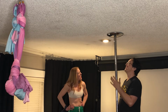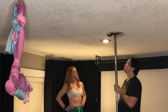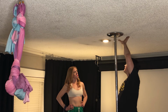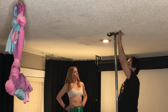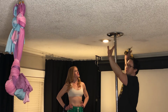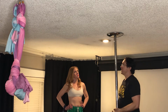We'll link it below. So this isn't holding up anything, isn't really part of the structure, but because we have it here and people are swinging on it and we want to make sure that it is as safe as possible, we're going to add extra reinforcement from the attic, spanning between the ceiling joists to add a lot more stability, and it will allow the weight to be transferred across multiple spans of the ceiling joists, and makes it feel a lot more stable and safe.